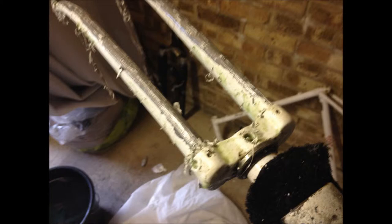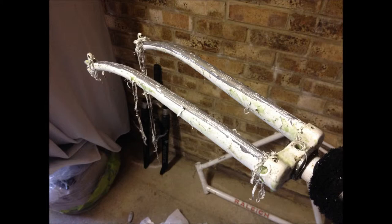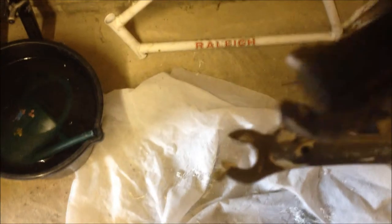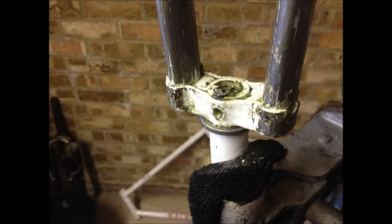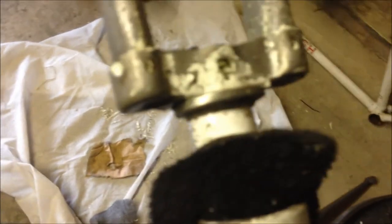Now we're ready for stripping. I used a razor blade scraper to scrape off the thick of the paint. You can use a wire brush but I find it gets clogged up with bits of paint, so you want to get most of the paint off before you start using a wire brush. I've got a little wire toothbrush here — you can get into all the detail and scrub off the rest of the paint until you're left with these stubborn patches, normally around the lugs. These lugs are pretty painful, you just want to keep working away — they just take time. What I do is reapply another coat of NitroMoz to these stubborn areas just to help break down that paint a little bit more.